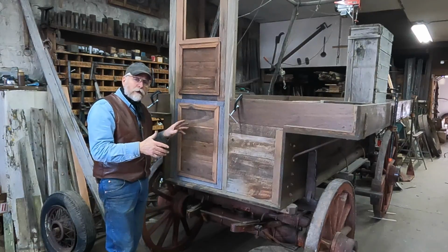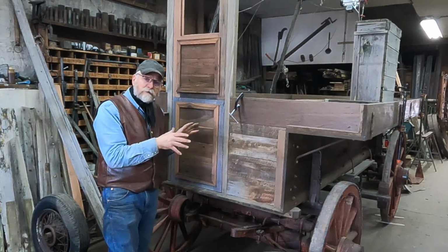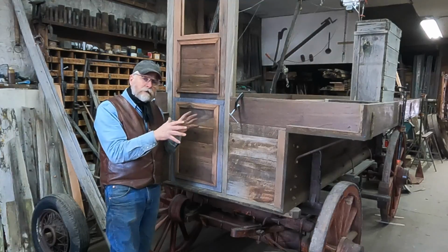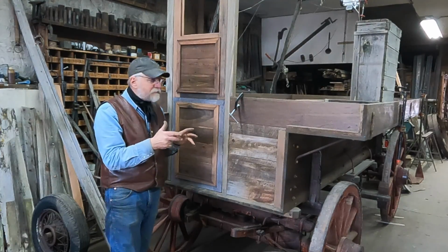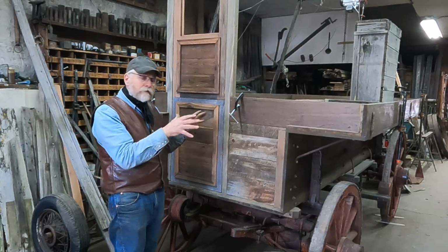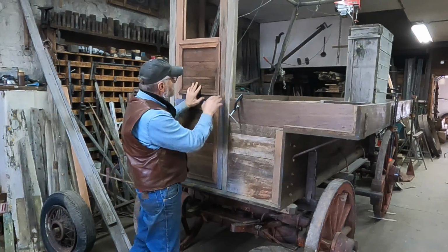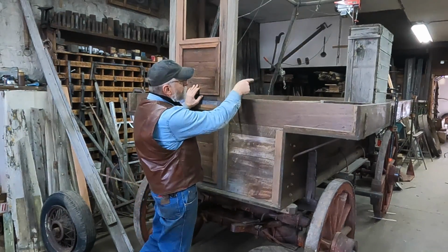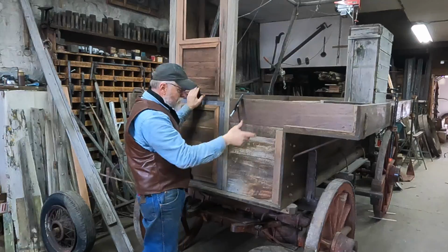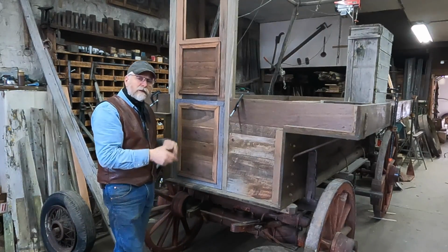And that's one thing that I'm liking about some of this old wood that I'm putting in here. The wood takes the stains differently depending on how much tannic acid is in the wood. So we got quite a different variation of different hues, from this gray to a lighter brown, to the fir, to the old original gray on the kitchen cabinet. It's just a nice blend, and I think that variety kind of adds character to this.